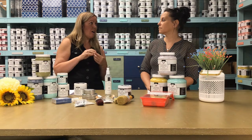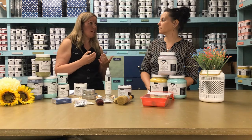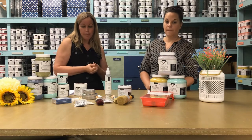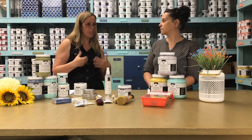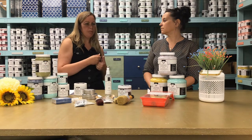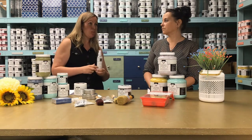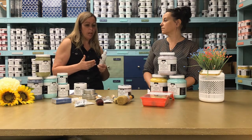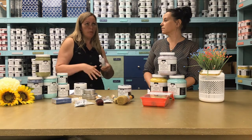You can use it on outdoor doors. Because it's outside, you need a primer before — an oil-based primer. But on most furniture, you don't require any prep if it's not shiny and doesn't have an oil paint or oil-based varnish, so you can apply the paint directly. Always check if you need a light sanding, and the cleaner is always good to remove dust and dirt and prepare the surface.